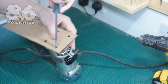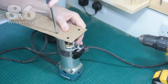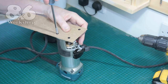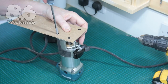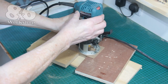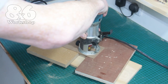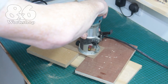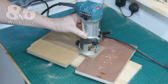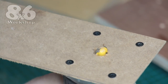Because this is a small circle and I don't have a circle cutting jig for my trim router, I rig up a quick and dirty Heath Robinson affair. I'm using a 2mm thick offcut of MDF. I prop up the router and manually push the bit through to give me a zero clearance plate — you'll see why later.